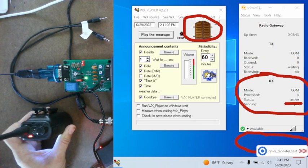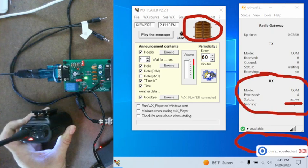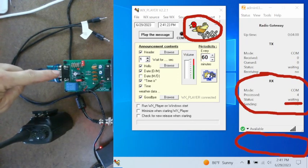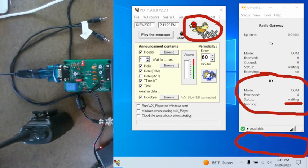Green light, shutter, active, bubble in the right-hand corner. If you do not get that, you have a software problem — you have a setting wrong. Remember, we checked the hardware with the DB9 unhooked and the green light came on in the first part of this video, so the hardware seems to be working fine. You have a software problem: either a COM port setting is wrong, your DB9 adapter is not working properly, or maybe the driver needs to be updated.